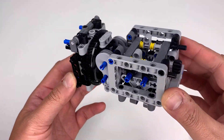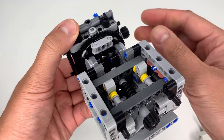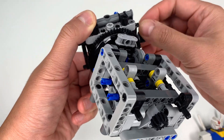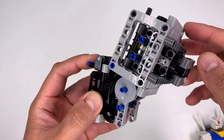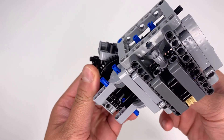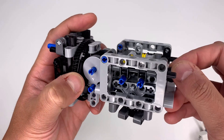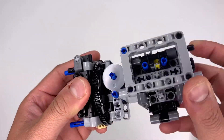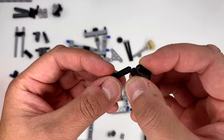This is the shoulder joint, and again we're going to touch on the points of articulation. Imagine this is plugged into the side of your mech — you've got a 360 degree rotation here that goes all the way around. You've got your lateral shoulder movement built in with these ratcheted click joints — go back down. You can also rotate while it's in its raised position, which is what we wanted. And then you've got your bicep swivel here, controlled by this drive shaft. Everything locks into place once it's moved — it doesn't move again. There's a slight tolerance but I'm happy to live with that for the purpose of this build.